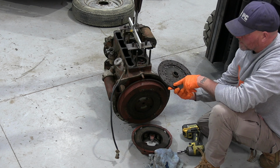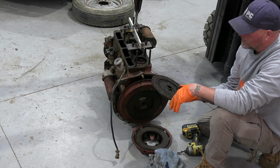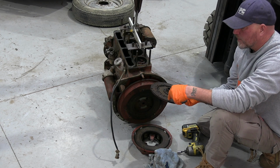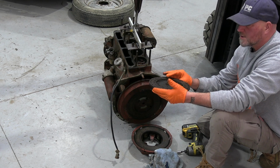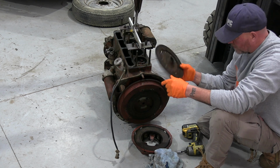But what you can do, if it's all impregnated with oil and stuff, what I've done before is put it on the barbecue, because I'm not allowed to do it indoors, I'll get told off. We chuck in a barbecue an old frying pan, fill it with water and washing powder, then boil it up and it comes up like new. And then just do it a few times until it's back to the normal colour. But yeah, that's what I've done before, which seems to work really, really well.